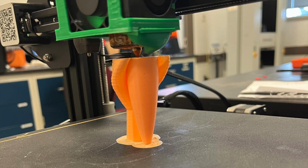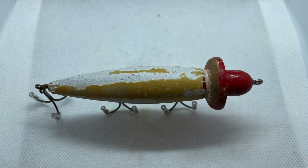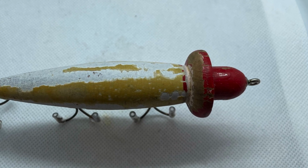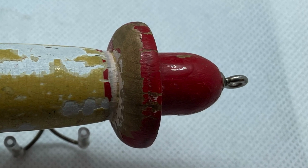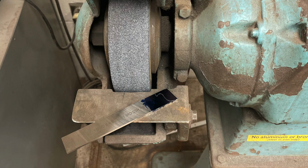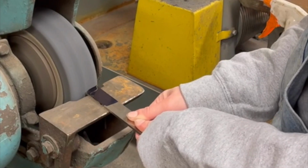In order to manufacture these lures, we ran into a lot of issues. The main issue being that the lures have what we named the hat. The lure's hat has an interior cut, which is really, really difficult to manufacture if you do it in just one clean operation. So our solution, after weeks and weeks of trying to figure out the best solution between ourselves and Dr. Johnson's help, we wound up manufacturing these in two sections, the hat section and the body section.